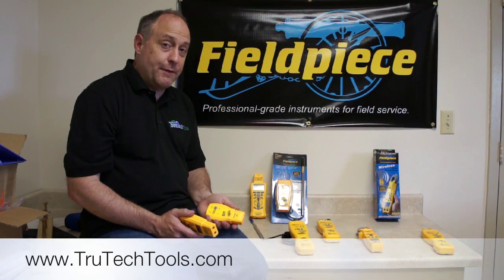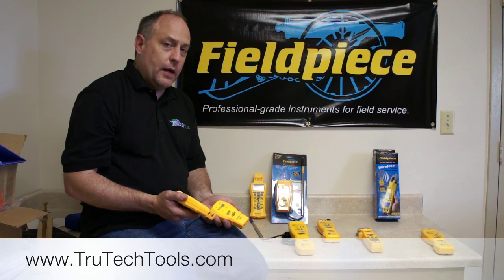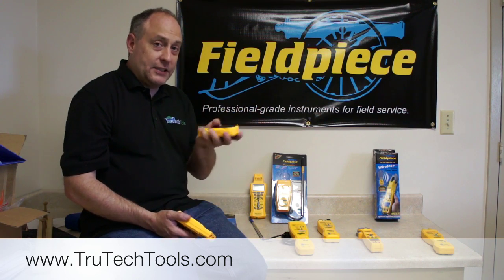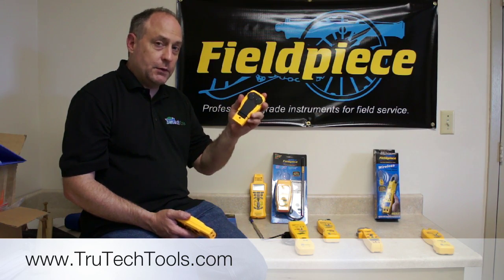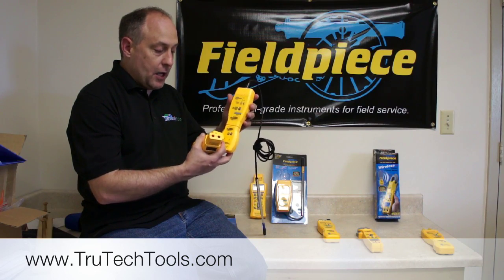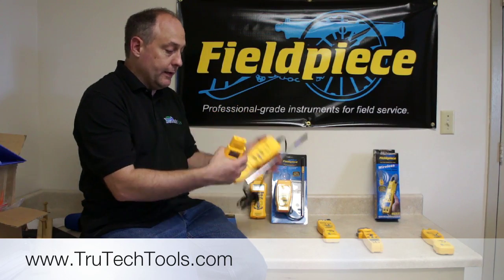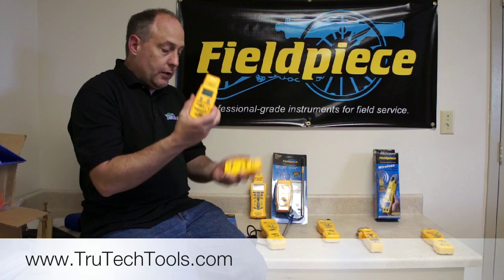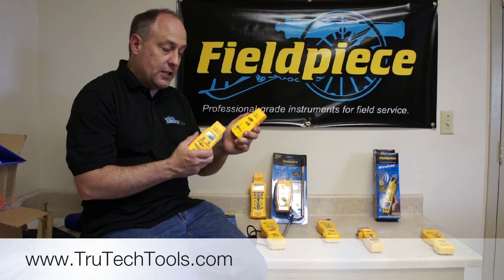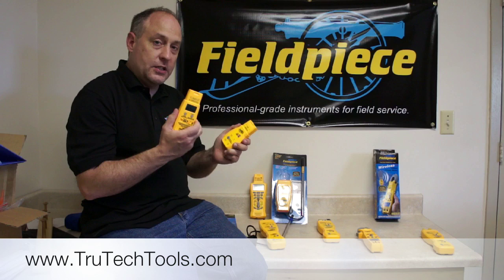The FieldPiece EH4W is rated at 75 feet — we're easily able to get over 300 feet out of the unit. The trick to getting good distance out of any wireless is to make sure the transmitter or antenna is up as high as possible. FieldPiece has magnets on the back, so you can clip this to any head and get it up as high as you want. When you purchase it, it comes with a wireless receiver and a wireless transmitter. If you purchase a second transmitter, you can actually use it as a repeater — it will rebroadcast the signal to the handle, effectively doubling your distance if you need to.